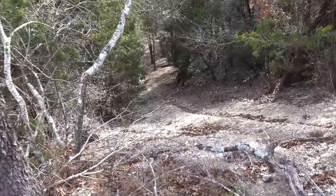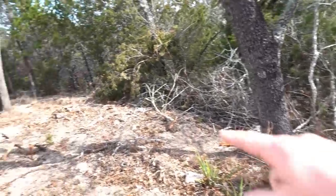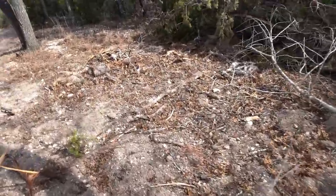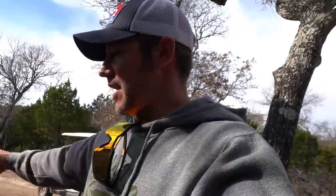I'm driving to the top of the range right now, which is where we'll put the big tank. This goes down, you can see the dueling tree down there, goes down to the range. So I'm thinking somewhere here, oh, that might be a perfect spot right there. Right here, I see a flat spot. We'll put that tank, and then I gotta figure out where to run a pipe down the hill. Maybe I won't bury it, because it's gonna be real hard to try to bury a pipe here. The only reason I wanted to bury it was to protect it from cold. I think I'll just put a valve up at the top, so when it's going to freeze, we just leave it empty. That's a good plan, and we'll just bury it down there where it's flat and I can actually get to it. I'm gonna go get the bobcat and we'll bring the tank up here and flatten out a spot for it. This is gonna be great.